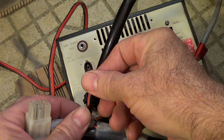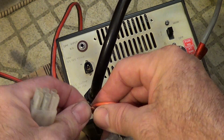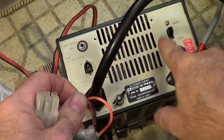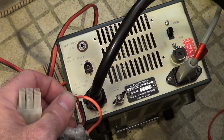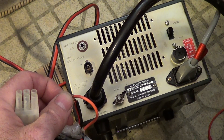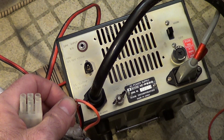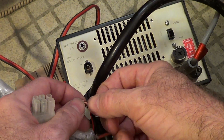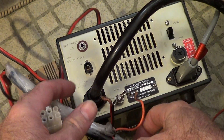I've been doing that sequence for a year or two, but then this morning I had it hooked up, left it on all night, turned it off, then turned it back on after a minute or two and it powered up without going through the sequence. It could be that there's a capacitor gone bad in there — an electrolytic — and the sequence is goofed up because it's not pulling something high and it's being held down by a bad capacitor. I could believe that, but for about a year or two I've had to turn the main switch on then ground the orange wire to get it to work.